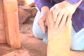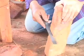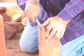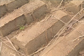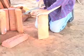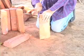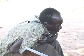So we're going to cut this notch about 10 millimeters deep, and then we'll cut this notch on this side. Eventually these bricks will all be pre-notched because we're making a mold that will make the notch in the brick. But these first bricks we have to notch, and we're using this carbide blade that has special abrasive grit that cuts bricks on the side. The brick is soft, so even a regular metal blade would cut it, but slower than this blade.